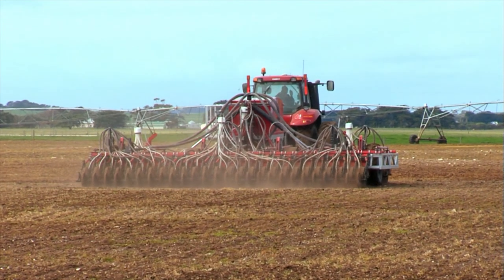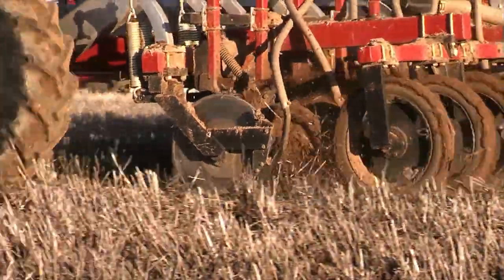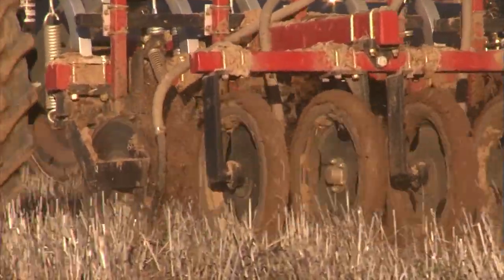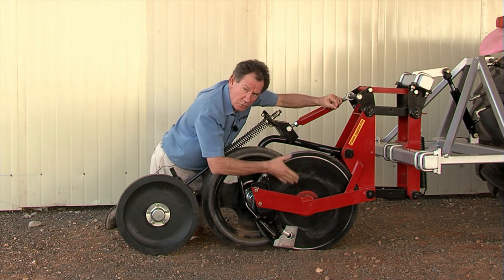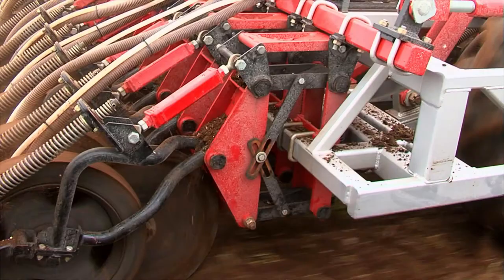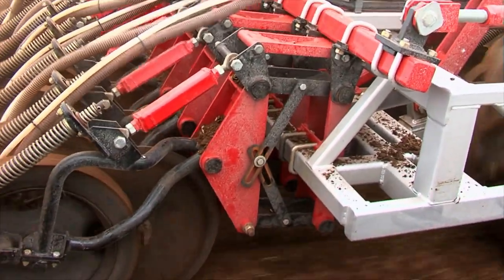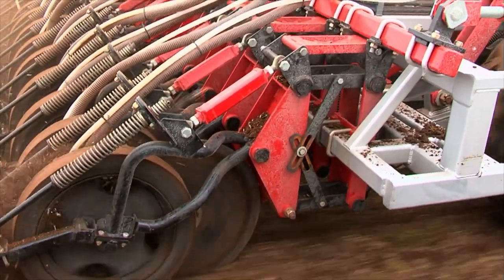The reason for that is the mud is pulling on the bottom of the disc to rotate it. If you were pulling on a disc that was difficult to rotate in mud, you'd want to be pulling on it out wide rather than up close — so the more leverage you have on the centre, the better. Also, the bigger disc means the bearing is up out of the mud more, it's not down amongst the dirt and the violence, giving it a much better chance.